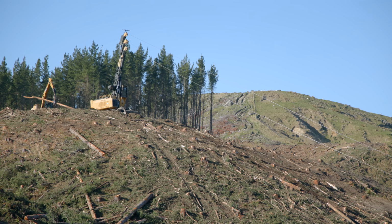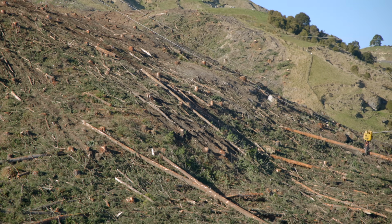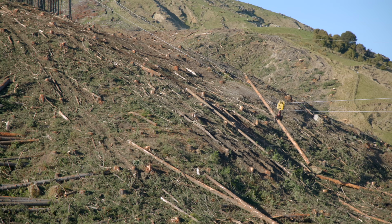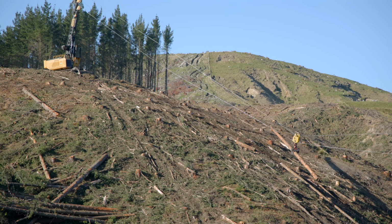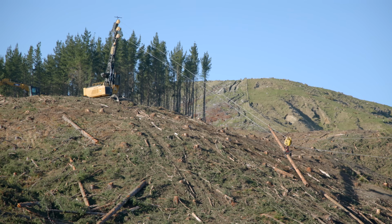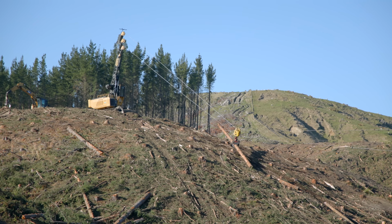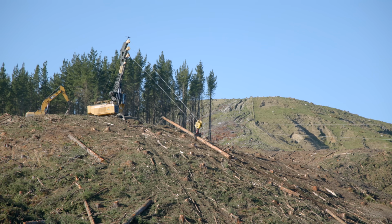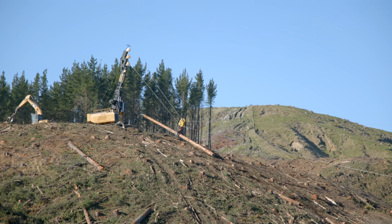So, I had a big yarn to Dan. He told me a few things about that hauler. He told me they've changed a lot around on it. So now they've taken out the 7/8 rope, put the inch rope on, bigger drum, and swapped the sheaves and the drum positioning for the main line and the tail rope.